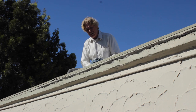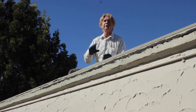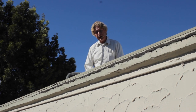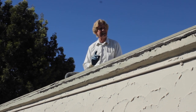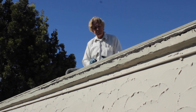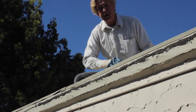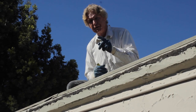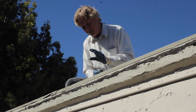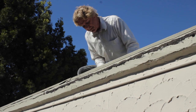What they have here is a problem. What they did is they put a flashing here — a flashing cap will last a few hundred years — but it didn't last that long because it cupped. When they cup, they hold water. So they put a new roof on here and then took the new roof membrane and went over it. That's a good idea, but what somebody did was they kind of screwed up.